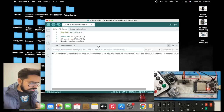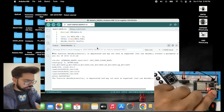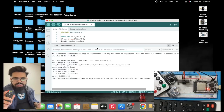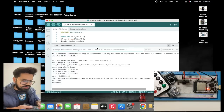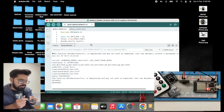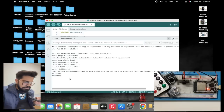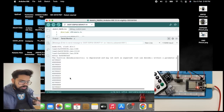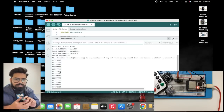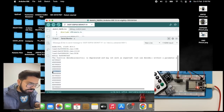It is uploaded — let's go to the serial monitor. Once we reset the MCU, I'm holding the remote and pressing a button to see whether it shows a specific value. As we can see, there are specific values like 807FC837 and FFFF. Every time I press a button, a specific value appears. I'm pressing the OK button — so the IR code for the OK button is 807FC837. This is from my projector remote.